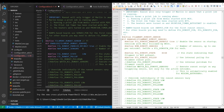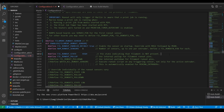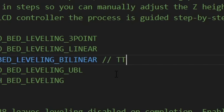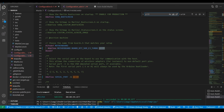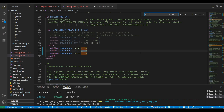When making this video, I wanted to compare the old and new versions of Marlin to see the differences in structure, so I went for the most primitive technique — scrolling through the two files side by side and copying over any changes I've made to suit this printer. There's one technique I finally adopted from my patron Patrick: adding a comment with my initials after any individual lines that I've altered. That makes life easy in the future because I can search for that comment and very quickly loop through my code, finding any customizations I've ever made.